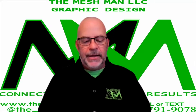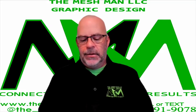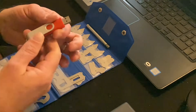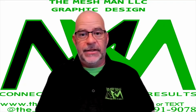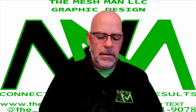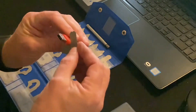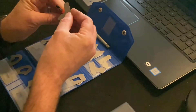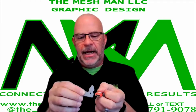Just to give you a quick idea, let's say I have this USB thumb drive and I wanted to make a holder — I want to cut a hole somewhere so I could actually just drop this down into it. So I need to know the radius on it, because we all know these have radiuses on them. What I need to do is figure out which gauge matches. First thing you do is eyeball and see which one looks like it might fit. We're going to start with this one — this is a 9/64ths. We can just take it and lay it up against the side. We can see there's still just a little bit of gap; it doesn't quite sit right.